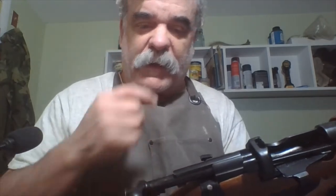Trust me, the sear is sitting right here. You can imagine that thing sitting inside there — there's your sear. Now before we go on, there are two locking lugs for the bolt. You have one sitting on the bottom right here, and this big long piece right here is the other locking lug. They have to line up so you get even pressure on both of them.